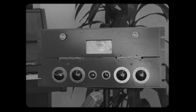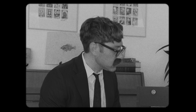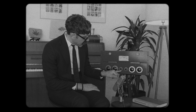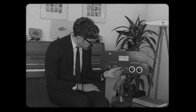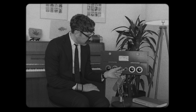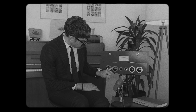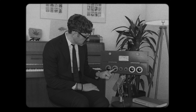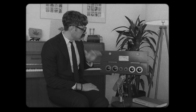Another reason why this guy is so cool is because it has the original tube power supply. Audioscape took a few liberties to make sure efficiency and modernism were in play here. To note on the added attack and release: if you set it to stock — centered for release, fast for attack — that gets you to the original RCA sound. At 24 is stock for the threshold. So this setting right here is 100% circuit-wise, down to the T, of the original.